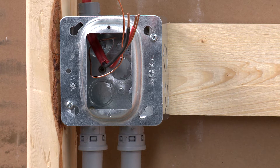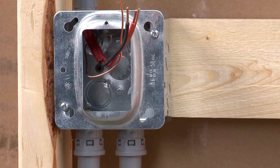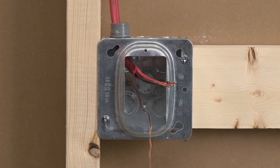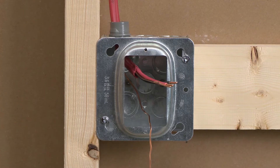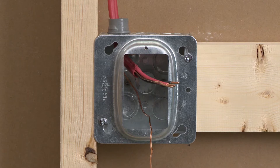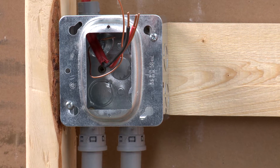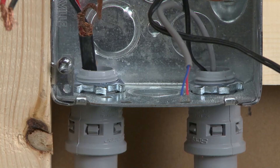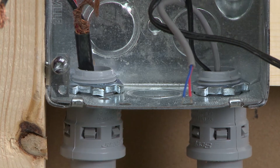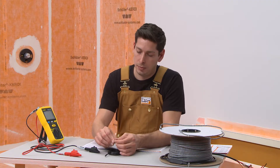The electrical preparation has already been completed. A dedicated circuit has been run to the thermostat electrical box; a branch circuit taken from an existing circuit providing power to other room heating devices would have been acceptable as well. A single-gang deep electrical box or a double-gang electrical box with a single-gang mud ring is recommended to provide room for the wiring. The junction box must be sized according to the electrical code effective in your region and must consider the possible use of pigtails and the space occupied by the rear section of the thermostat. Install one or two sections of conduit from the electrical box to a hole at the base of the wall. The heating cable cold lead will run through a conduit, while the floor temperature sensors need to be threaded either inside the same conduit as the cold lead or in a separate conduit. The floor temperature sensors must be tested using an ohmmeter or multimeter to verify accuracy prior to installation.